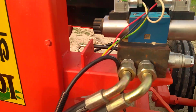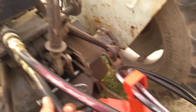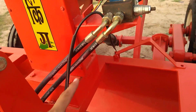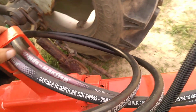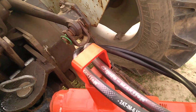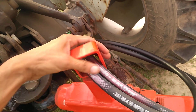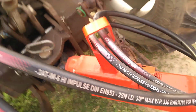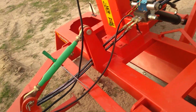Outside, the T — T means tractor, or you can say tank. Then this T should be where the hydraulic oil comes back to the tractor. You should connect in this way. And how you can put the hydraulic pipe: there is a special place underneath, and through this when the tractor runs in the field and turns left and right, it can protect the pipe from getting caught on a hook, otherwise the pipe can get damaged. It will protect the pipe.